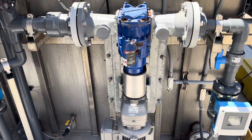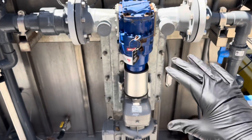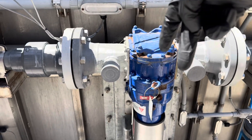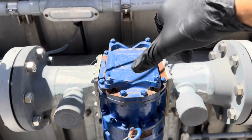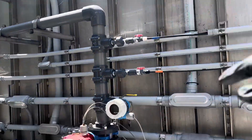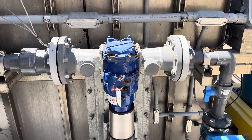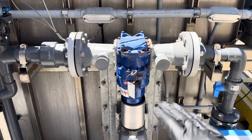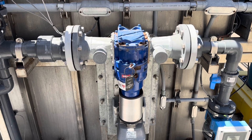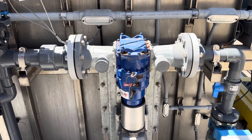What you're seeing in front of you here is a type of positive displacement pump called a lobe pump. Here's the motor — this is a 460-volt three-phase motor. We've got the shaft coming up through here and some pump components, and right here is where the business happens. Imagine these lobes — they move and they displace the water to pull it through. The pipe follows up into the membrane chamber, and the reason lobe pumps are used on membrane filtration is because they can create a gentle steady flow. On these we're actually pulling a vacuum — not pushing against them. These are really ideal for membrane filtration.